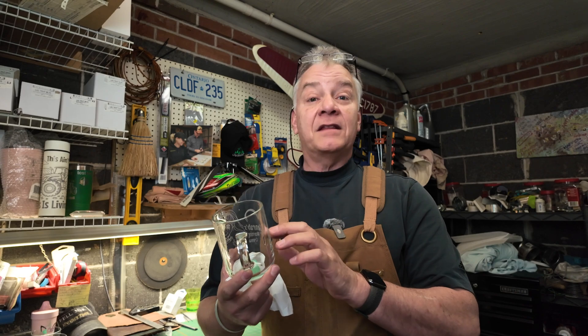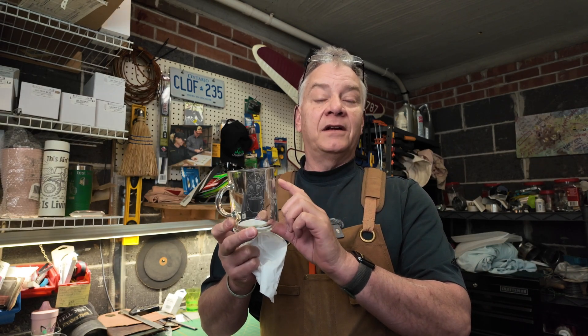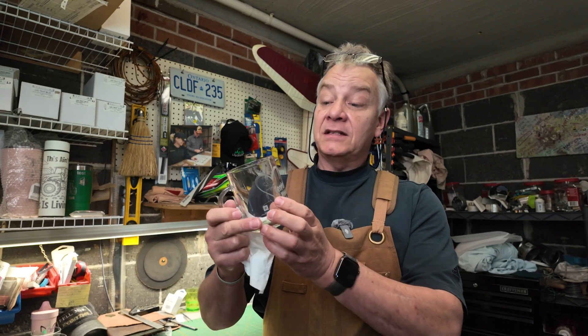Definitely far better results than I was able to get eight months ago. The mask makes a big difference, as well as the speed. It's certainly not the same quality as sandblasting, and from what I can see, a UV laser will still apparently produce a much better result. But with the 1.5-inch lens, I would sell that engrave — that's a pretty nice engrave. To those who watched the video eight months ago, I apologize. There's so much a laser can do, and there's a big learning curve. If you've got spare glasses in the kitchen, give it a shot. Use paper mask — or even regular masking tape. Let me know in the comments how your test results turned out.